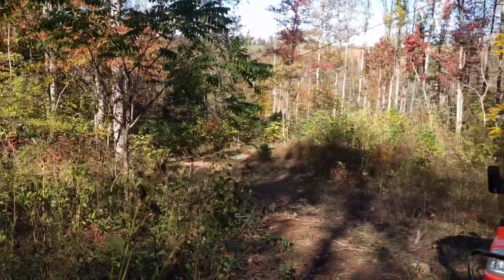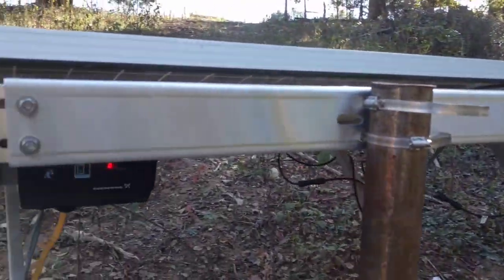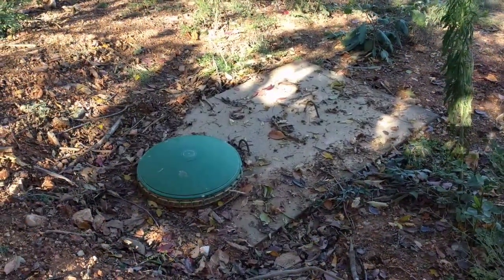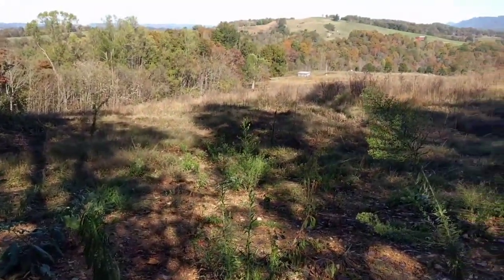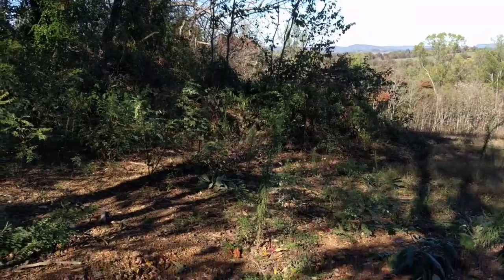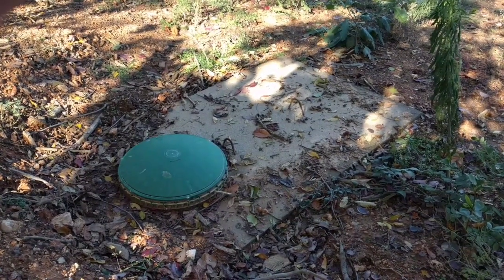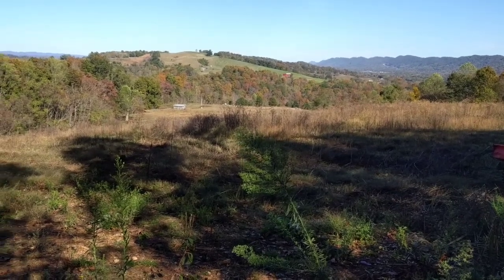Let me go show you the other tank. Here we are — top of my world, 1,700 foot in elevation. It's a beautiful view. So right here is the supply tank, or the holding tank — 1,400 gallons. It's pumped up from the pump tank via solar pump. And then it runs down through there to the pastures to fill up the troughs — the Marifont troughs.